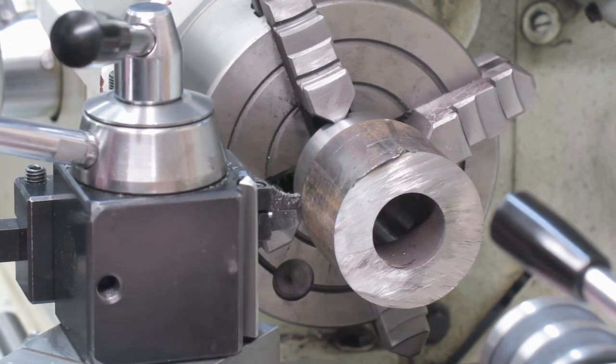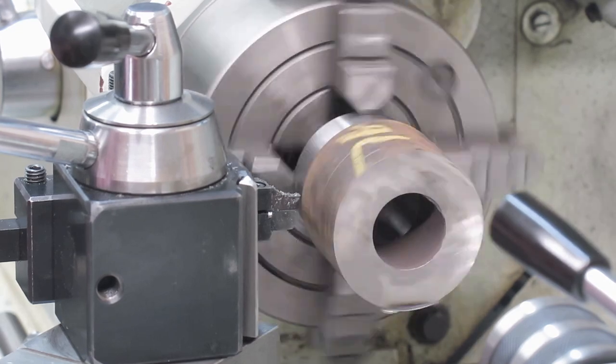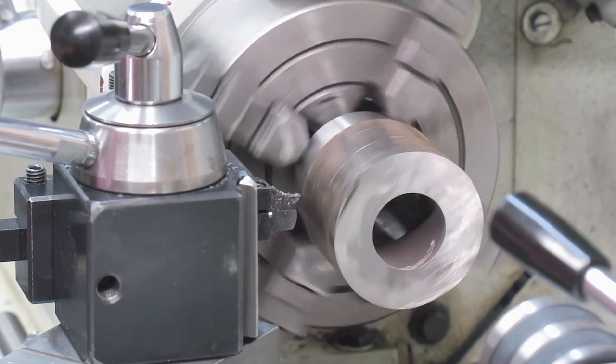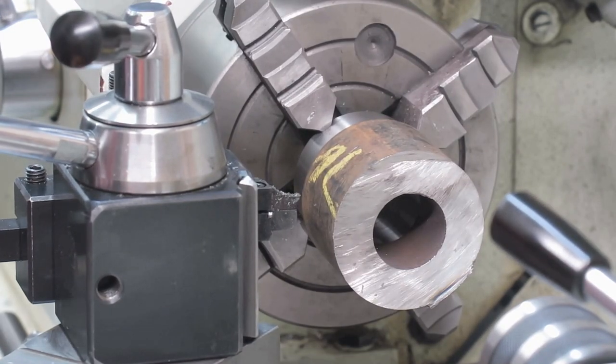And then I have now placed this carriage so that it is... this is loose. We need to tighten everything, otherwise this will shatter anyway, I believe. So I have now placed it so that what remains there is about 10 millimeters. And now let's see what kind of chatter we get. Furthermore, this is sitting only on one of those teeth of the chuck, so it's not very tight.